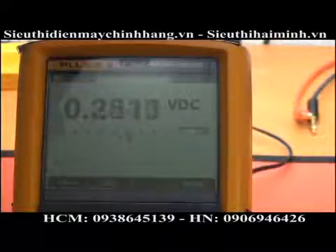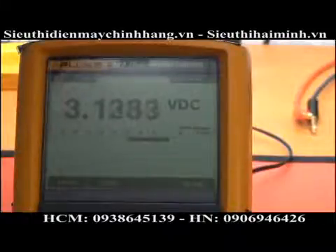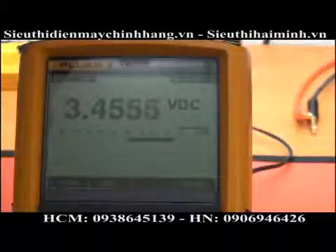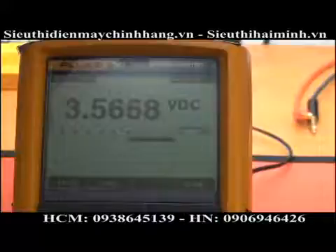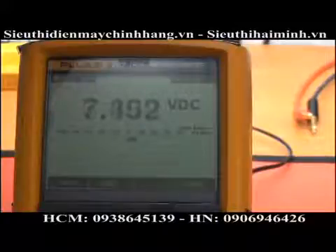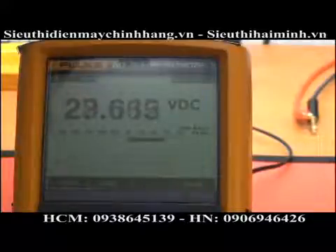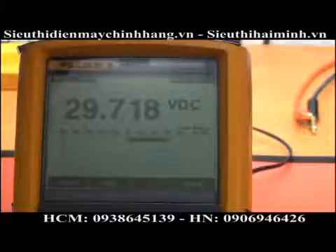The resolution below one volt is great. As we step up, you can see the nice big digits but notice the slight ghosting as they change — if I'm tracking something like a capacitor charging, the update speed is great but the ghosting is where a seven-segment liquid crystal display performs better. As we go higher it over-ranges and drops to three decimal places. We'll take it up quickly to the maximum of my variable supply — 230 volts — and there it is, no problem at all.